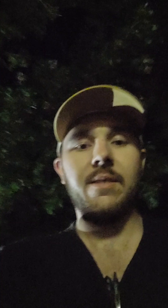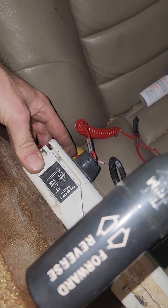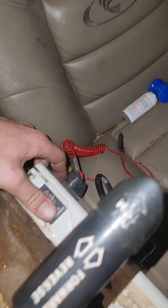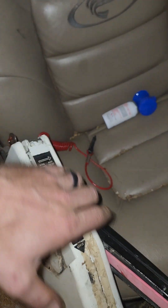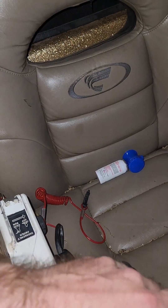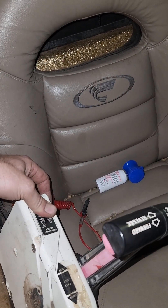The next thing I'm going to address is the linkage, because the high idle — the elevated idle lever — won't stay down. When it's popped up like that, it's not actually engaged. It does go down when you rev it up since it obviously engages then. I have to remount this throttle box, but I need to figure out why that lever isn't staying down.